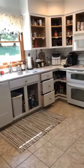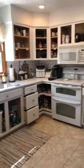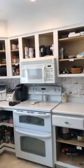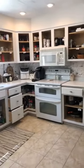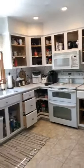Yeah, I'm really happy. One thing I forgot to tell you guys, one of the most important things you can do is to number your cabinets. Like I have number 2 here, number 3, 4, 5, 7. When it's time to put them back on, your hinges are all put on manually, typically. So your cabinet could be a little wonky if you don't put the same cabinet door on the same opening. So anyway, this is where I am. That's one thing I wanted to show you. So I put the number 10 on number 10, and then inside the hinge holes, I'll show you.